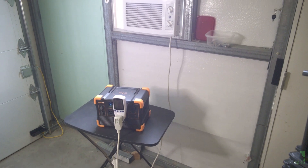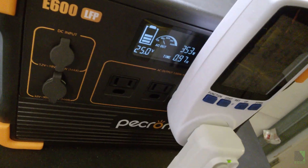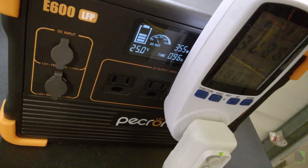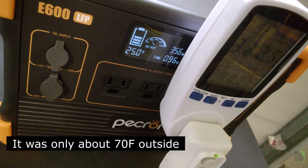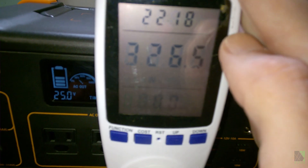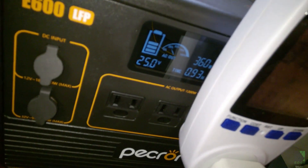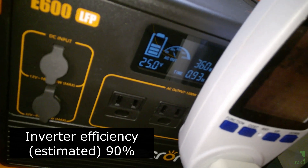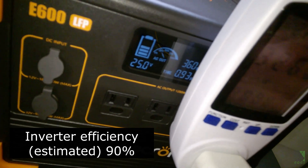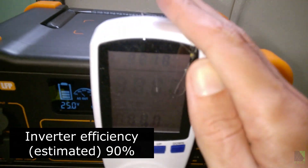I was a little bit surprised — it started right up. Let's take a closer look: 353 watts. When it's 80 to 90 degrees outside it will be over 400 watts. The AC wattmeter I'm using is showing 326 watts, whereas the E600 display is showing 360. I suspect the unit is measuring at the battery pack while my meter is measuring only at the inverter output.